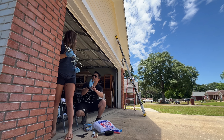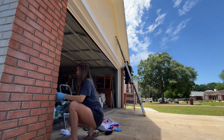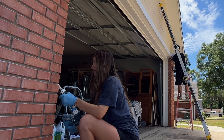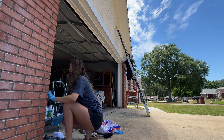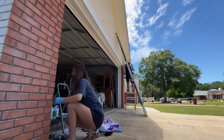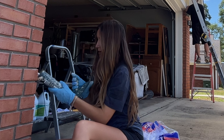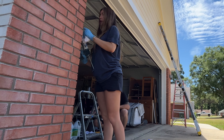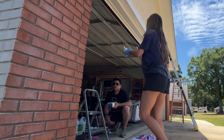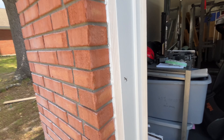I feel like I'm George because I thought of something after I should have said - well at least you wore protection. The idiot store called, they're running out of you. Prep sucks but at least it takes a very long time. It's going to feel that much better when we know we did all this and it's painted - not just looks pretty but we've sealed up areas where bugs can come in and moisture can get in. Counter-sinking some nails, putting a little wood putty on them. The ones that aren't counter-sunk rust and come through the paint. Trying to cover some of that - certainly not the prettiest job but we're trying to get better than it was.